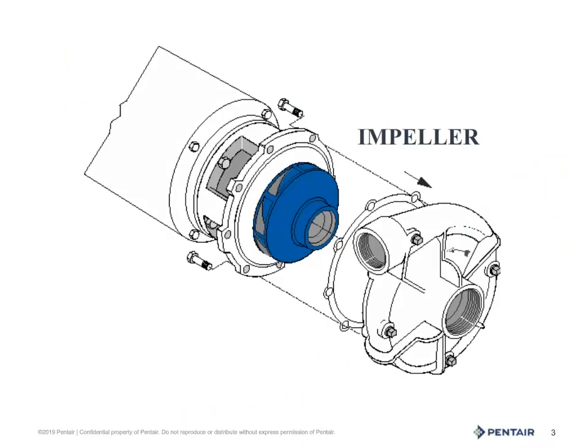The impeller is the key to the centrifugal pump. It is the only moving part and the only part which transfers the energy of the driver into the system. Understanding how it works and what can go wrong with it is the key to maintaining a well-running pump system.